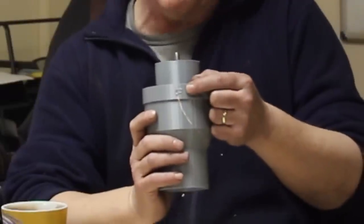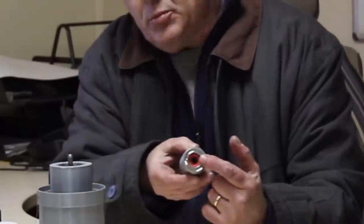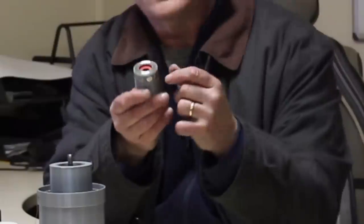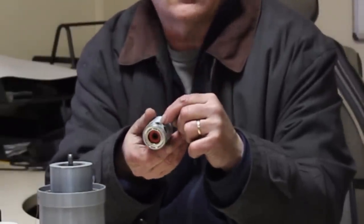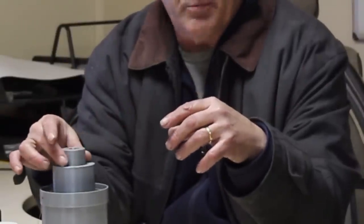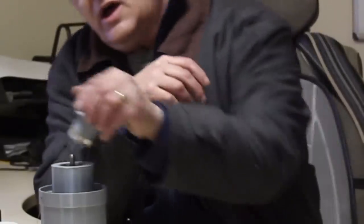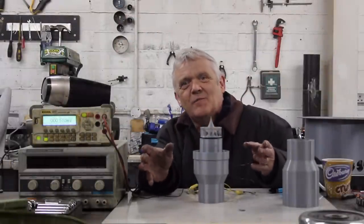A spot of hot glue finishes that section. The rotor section is really easy: in the little indent in the bottom you put the other half of the thrust bearing; in the center you put two skater bearings; and round where the dimples are, there are eight magnets — 3mm by 10mm circular magnets, north-south north-south, N35s. Before you drop those on, you need the rotor head — pop the rotor head onto the magnet rotor and then that drops on.